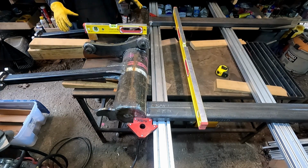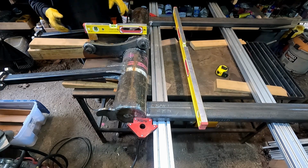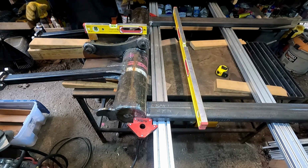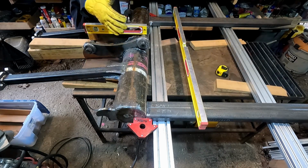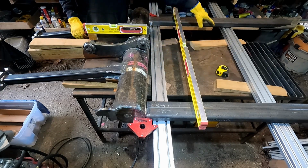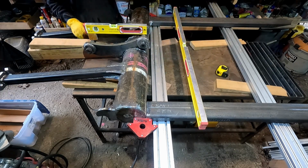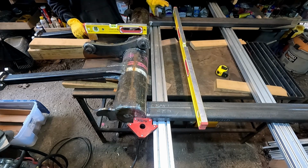Set up the rest of the weldment in build orientation. The lugs are 2 inches different. Tube is level. Brought in 2 pieces of aluminum extrusion to extend my workbench wide enough to support the forks. 4 wooden wedges let me adjust the height of those. I set the top surface of the forks coincident with the center line of the tubes. So that's measured down from a level 3 5/16.